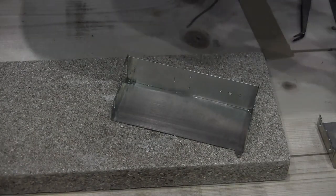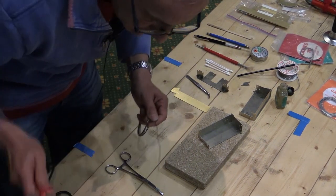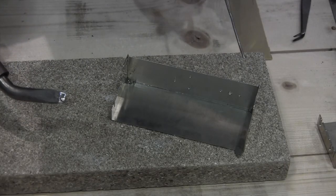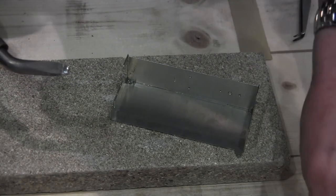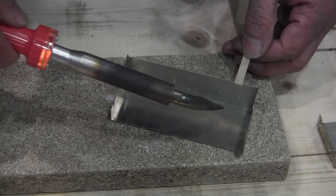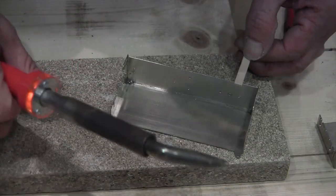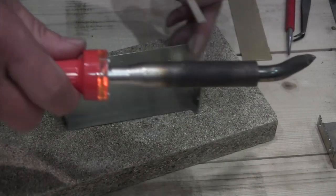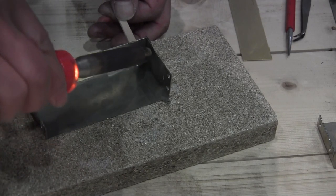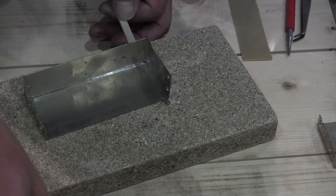Okay, we're going to use the green label solder, the 188 solder, so just drop that in, clean the bit on the wet sponge. Hopefully you can see a nice clean bit, and can you see the solder went onto that really, really easily. Now you want to hold the joint together, and you can use anything handy. I've just got this piece of wood, a handy Starbucks coffee stirrer. Unfortunately, the bit's in the way, but you can hear the flux. Can you see that joint going along? I'm just about out of solder, so again, a bit more onto the iron.